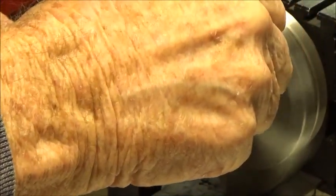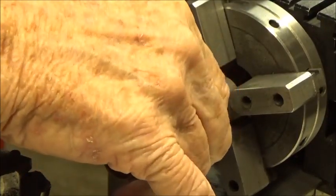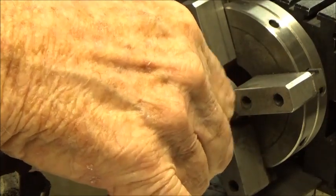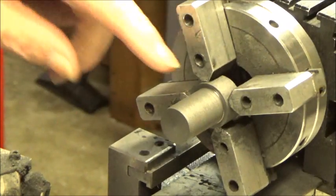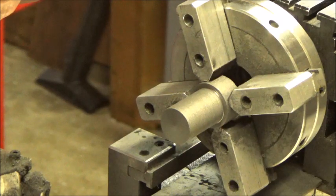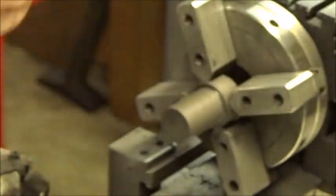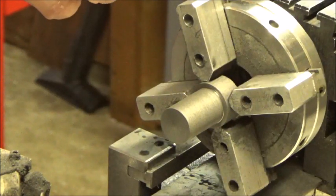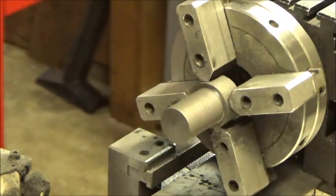At this point we're going to introduce a piece of emery cloth. We've got to be very careful doing that. The piece of emery cloth I just touched it with was a little bit too coarse. Luckily the fit looks okay, but we don't dare touch it again. We've reached the point where the tube fits over it fairly nicely. Actually, this graphite is so soft that you could just use a piece of paper — that might be the best way to go rather than use emery. I think we've reached the point where we're about half a thou underneath the tube size, and the piston fits in there nicely. So we've got to take it out and turn it around and cut it off.